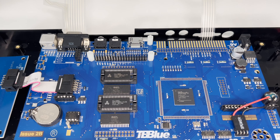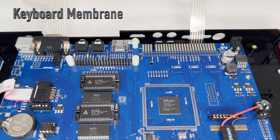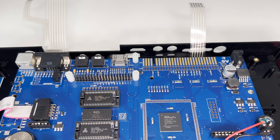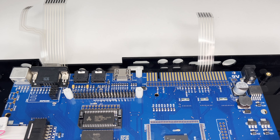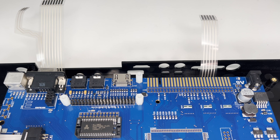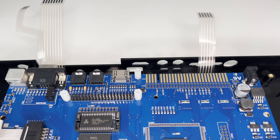We're going to shift focus to the keyboard membrane, which I mentioned at the beginning as one of the three big EMI contributors. Additional capacitance has been added to all of the signals in order to reduce high-frequency noise.